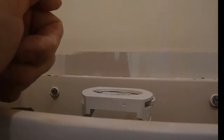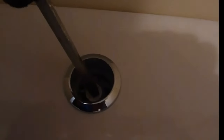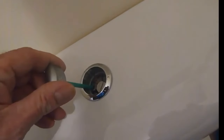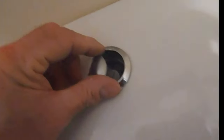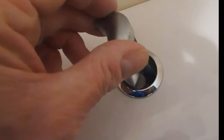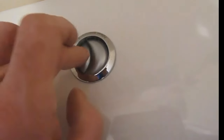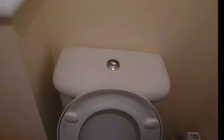Generally it's literally just about half inch above that level - just below that level there. That should be about right for our knobs to go in now, so once we're there just tighten that screw up - that's holding the siphon in place, it doesn't need much. Make sure these two stay level. That leads us to our buttons here that go in place - they just slot in there. One that side and one the other, you've got to get them around the right way. Push it in then put it down flat, make sure they're operating the plunger. We'll fill up the system, our lid's back on and we're all done.